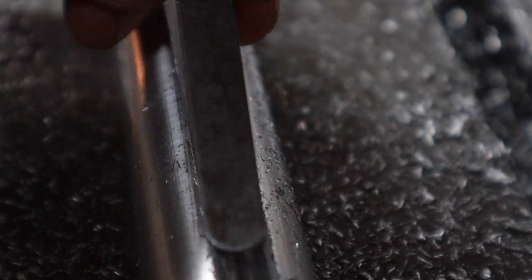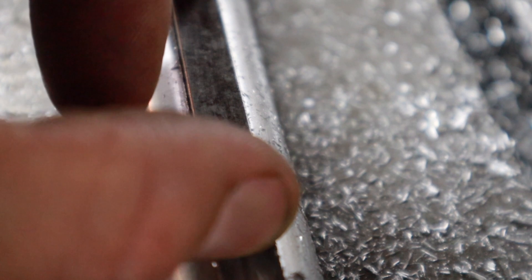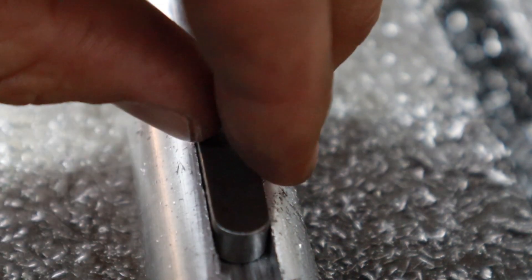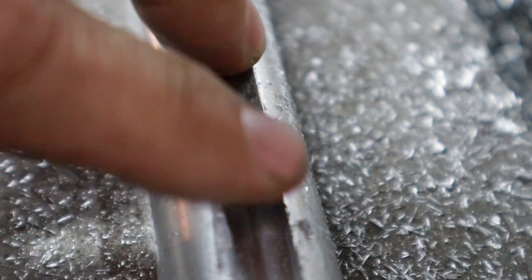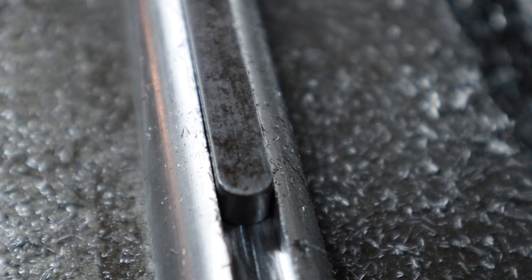It all looks pretty silver really. There you go — there's the keyway. You can't really slide it along, it's got a little bit of a burr there on the top. You can see it just fits in — that's what you want. It measures 8.05, so you've got about 0.05 clearance. So you can get your key steel in there, and then obviously our shaft will fit on over the top — I'll show you that at the end.